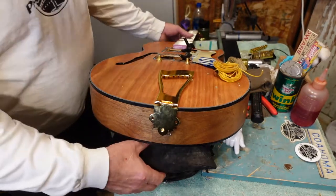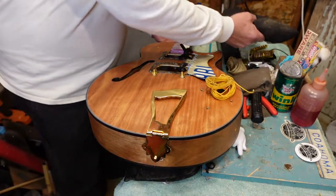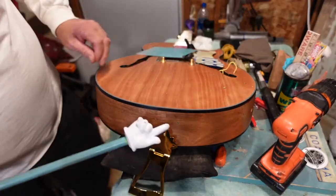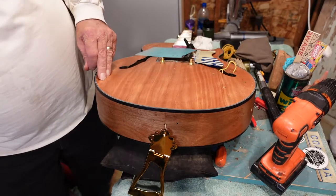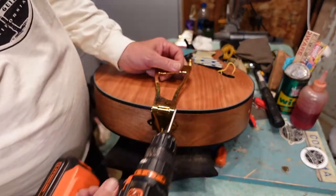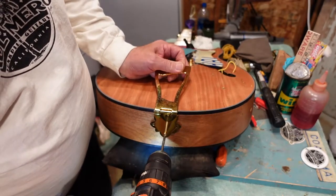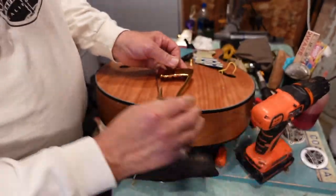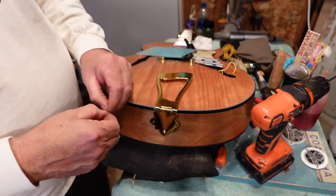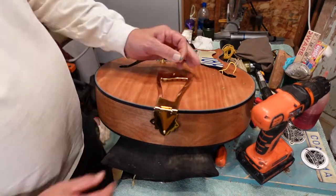I've got two ground wires now — two ground wires is better than none. Let me get this tailpiece put on so you can see that wire there, it's wrapped around here. Just want to make sure the clutch on your drill is set very low — you don't want to strip these things out. Hand tighten it up at the end, and we're going to tape this off. Of course, all these screws have to be chick-flick teal when I'm done — that's my artistic purview. Let's move on.